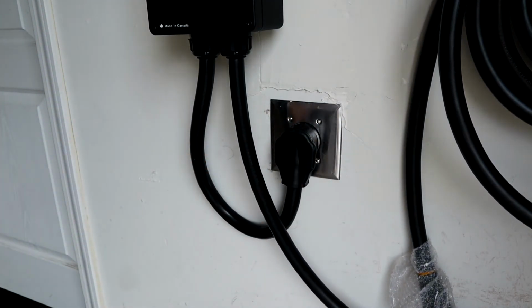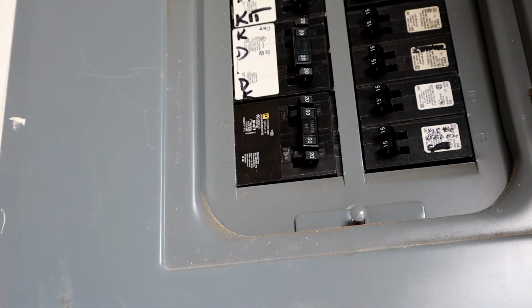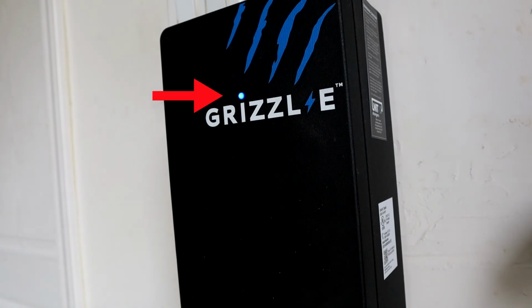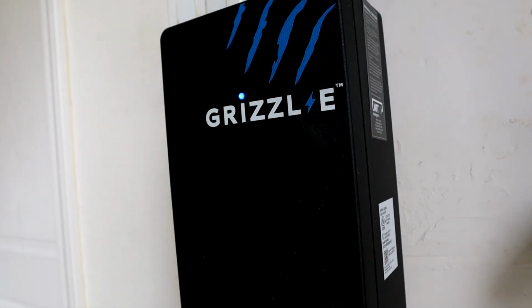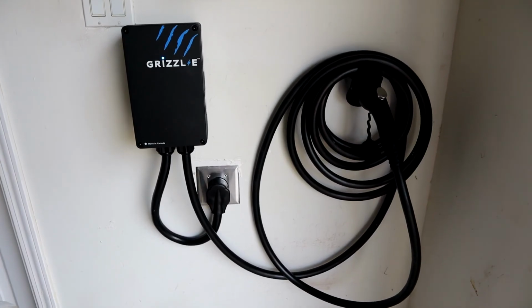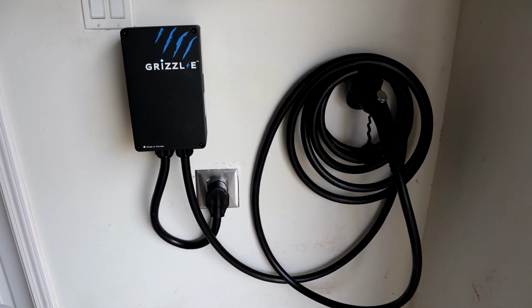Flip your breaker back on, and you'll see a rainbow of colors, and the unit should stop at a solid blue, which means the unit is ready to charge, but there is no car charging. That's your indication that the unit is good to go. And that's it. So that is the final product for the Grizzl-E EV home charger install. Hope that helped you, and thanks for watching.